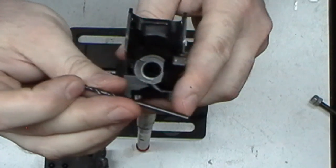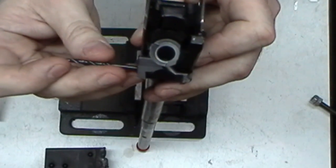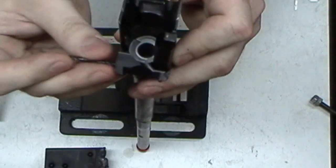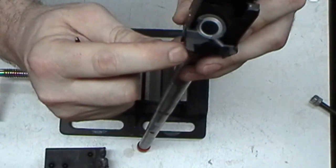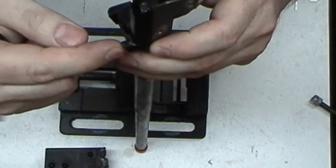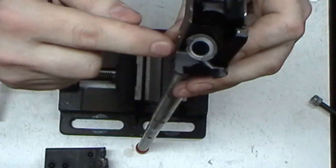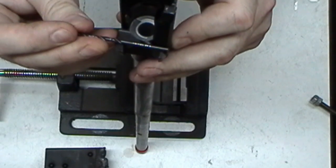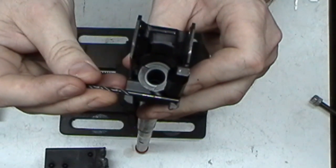The back side here, not the fluted side, the back side. Use this like a dowel. It should just make it through there. If you can just barely get that through there, that means it will be making contact on this top side of the trunnion hole, and the top of the barrel, which means that hole will match the factory now. That makes sense?